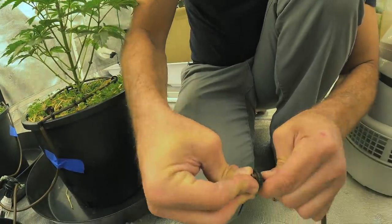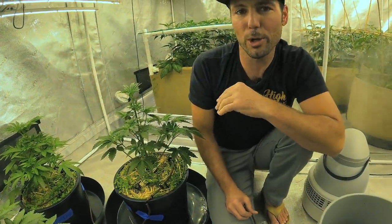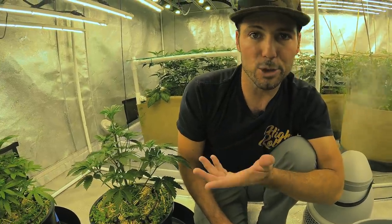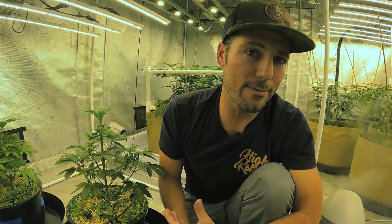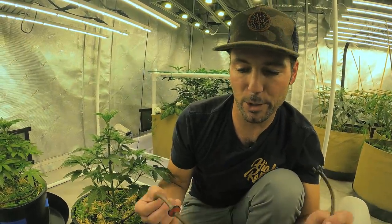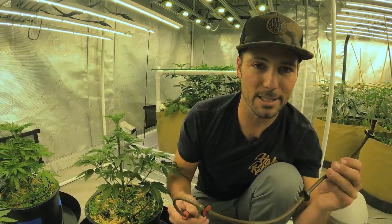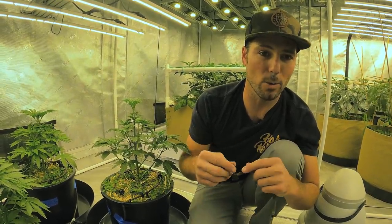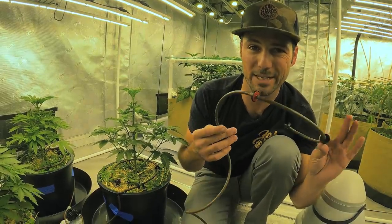And what I wanted to talk about while doing this is that there's a pressure concern, there's a water concern. When you're on a farm or when you're setting up a larger commercial grow, you have to start doing math when it comes to drip. And what you need to find out is your actual pressure and the gallons per minute, the gallons per hour flow of water that you have. And that'll calculate how many of these drippers you can have that'll actually safely operate. And there's 2 sides of that. If I put 10,000 of these 1/2 gallon per hour drippers on here, eventually 1/2 gallon per hour is gonna add up to the point where it's hundreds of gallons per hour and it's more than my actual water service can provide, so they won't be even anymore.